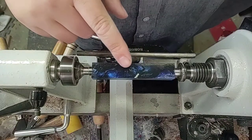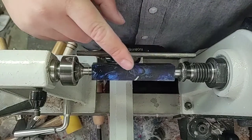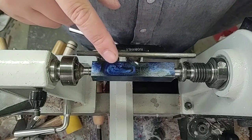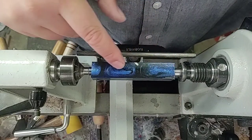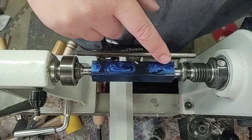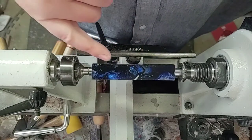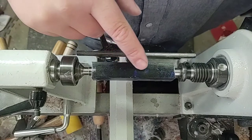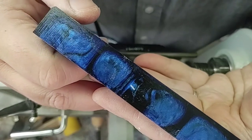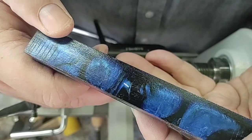We're going to be doing a special one today. This is a custom blank that I cast up for a customer. It's got a blue and black swirling to it. The blue he wanted was like an ink blue, so I added in blue Alumalite and then a couple of blue pearl powder colors from Alumidust and Pearl X in order to get a really deep, pure blue with a depth to it. The black is just black Alumalite dye. The black doesn't have any pearl powder in it so it sits right up on the surface, and then the blue kind of disappears off into the distance.